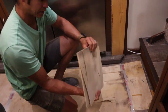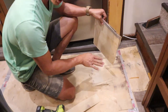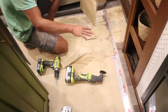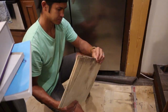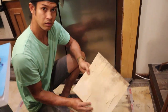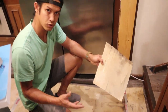We did find a little bit of water damage. The only reason we were checking here is because in this strip right here there are some soft spots. It's not damp that I feel, so we're going to look underneath and see what's under there. We'll have to replace at least this section of decking before we can put the new flooring on.